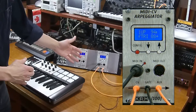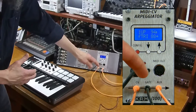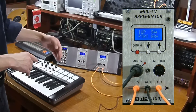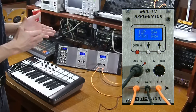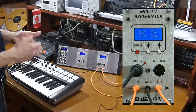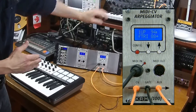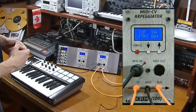The core functionality is what you would expect — it's a MIDI to CV converter. It has MIDI in, and the outputs are CV, gate, and an aux channel. The aux channel is currently mapped to the filter cutoff on my modular. The CV output supports 1 volt per octave (Eurorack standard), 1.2 volts per octave (Buchla/Electro-Comp standard), 0.32 volts per octave (EMS standard), and hertz per volt. In this demo I'm using my MS-20 mini, so I have the module set up in hertz per volt mode.